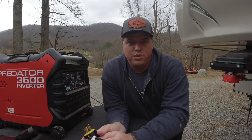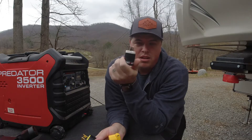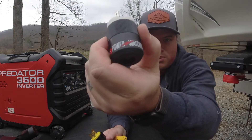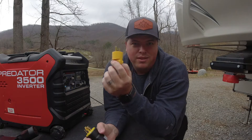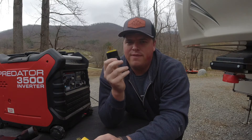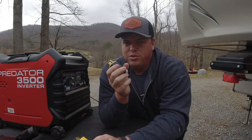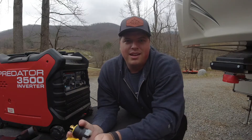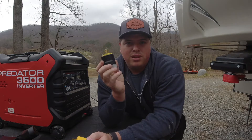This video shows you how to solve a very common issue with inverter generators — making sure that you've got that ground and neutral bonded. You can buy a $15-$20 plug with a Hughes Power Watchdog logo, and it's great, but in the spirit of saving money it's easy to build one for three to six bucks. The 30-amp versions will run you about $20-$25, and I haven't seen any factory-made 30-amp versions, but there's definitely a market for it. It lets you use your 15 or 20-amp plugs, and if you have an inverter generator with only one plug available, having one of these could definitely help you out.